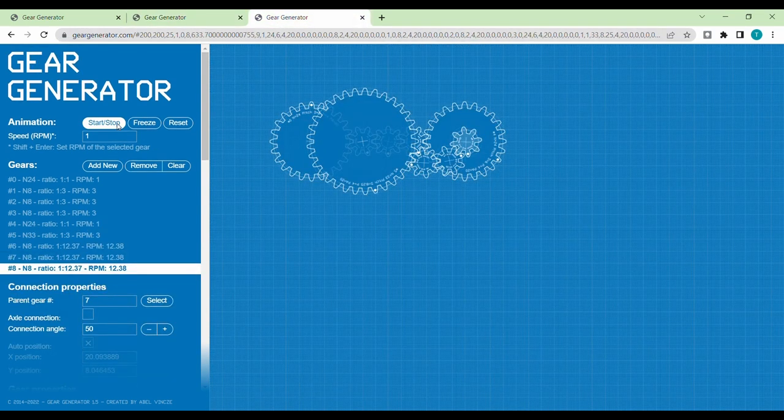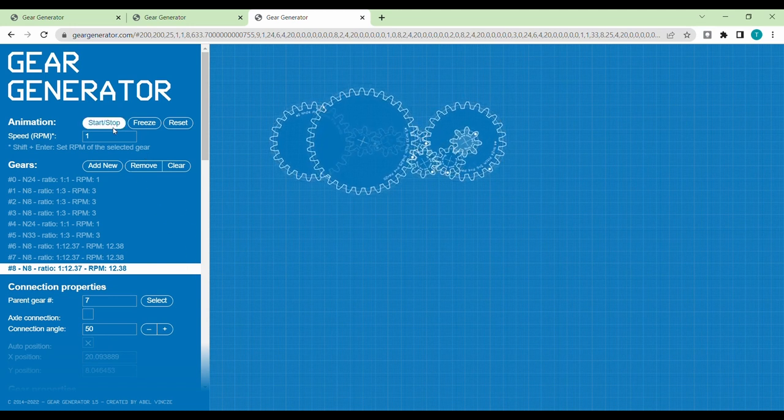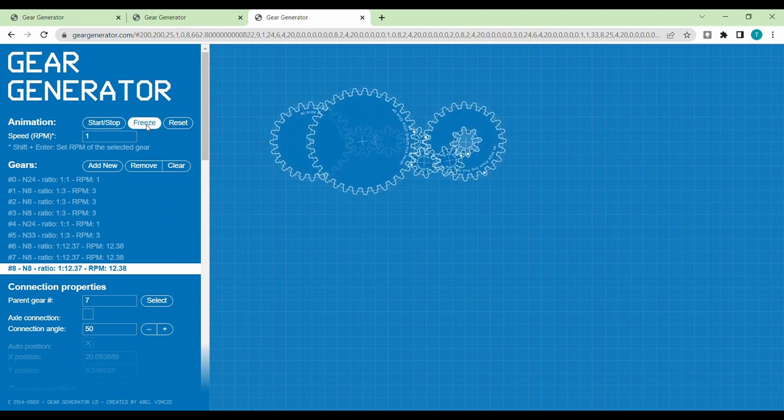I could manage it with just 3 gears, 33, 24 and 8, which was designed with module 2.5. To ensure that Earth as well as Moon rotate in anti-clockwise direction, additional idler gears were added.